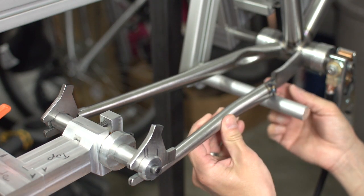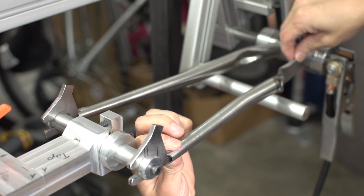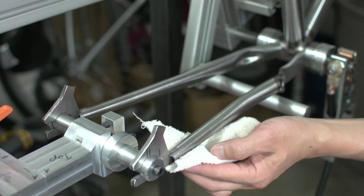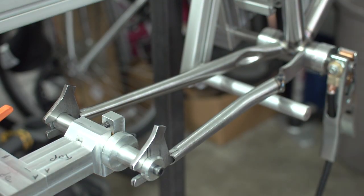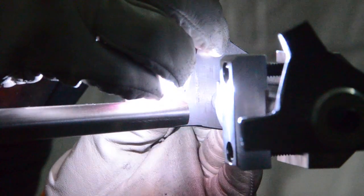In this video, that is what we'll be doing — welding the dropouts to the chainstays. I am not drunk, I swear. Maybe I am drunk with excitement. Tack welding — whoops! Here it is in slow motion. There was nothing holding the chainstay on, and when the heat heated up the chainstay, it just fell right out. The fit of the chainstay was holding it on there. So I tied it on with a piece of leather and used the chainstay rest. And tacking up the chainstays.